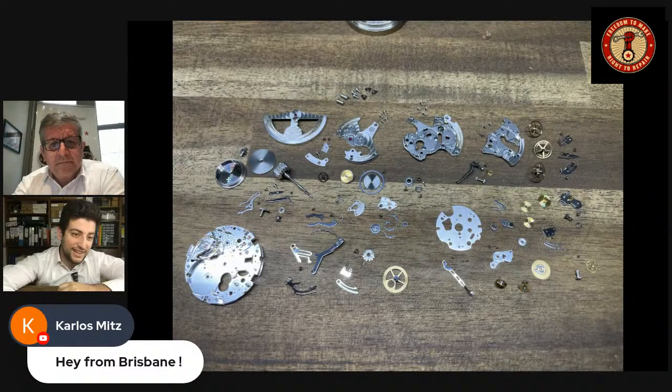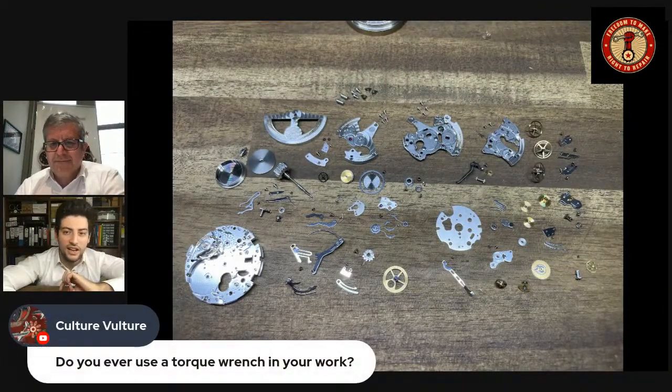But if you can see that color that's on the inside, that's just the bare machining finish. So that's not post-finished in any way. That's basically straight off the machine. And to achieve that color, you need a very, very sharp tool to cut the inside, sometimes even a diamond tool. And what we can see, the same on the right side, the hour wheel here, you can just see that green that's kind of reflecting off the wheel.